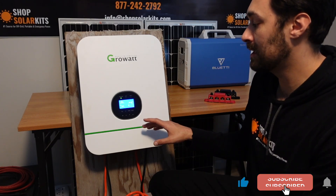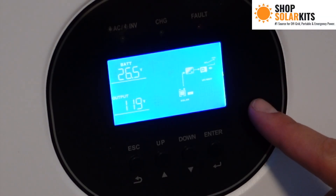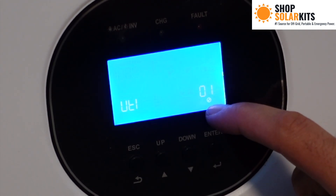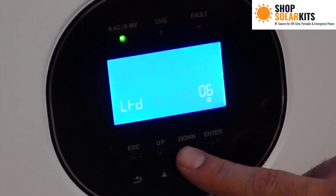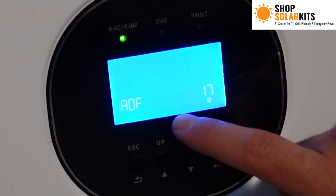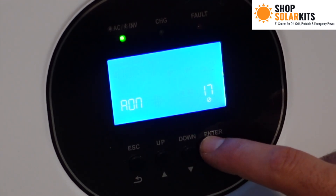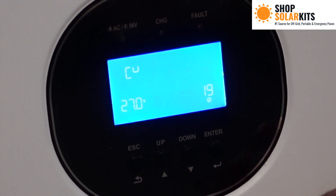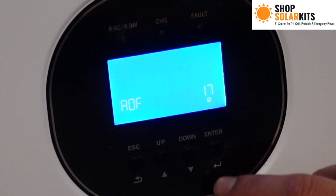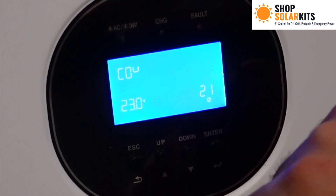One tip I'm going to leave you with is how to get rid of the annoying beeping sound whenever you click the buttons on the Growatt. In order to get rid of the beeping sound, go into the settings, go to setting number 17, and switch it off. To do that, hold down the Enter button. You can see we're on setting number one — hit down to navigate all the way to setting 17, then hold Enter again. It'll switch over to the beeping setting. If I hit up I've turned the beeping sound on, and you'll notice every time I click there's an annoying beep. Let's go back to setting 17, hold Enter, turn it off, and now I can switch around without beeping. This is going to save you hours of frustration.